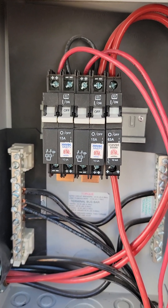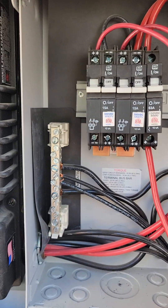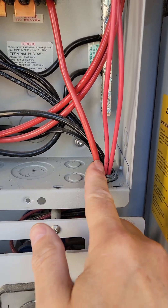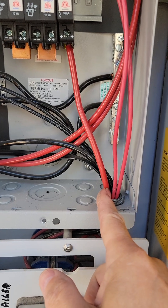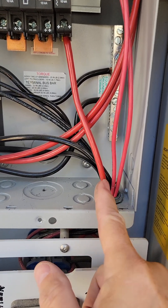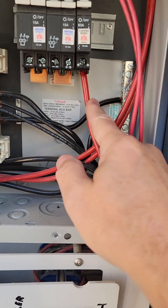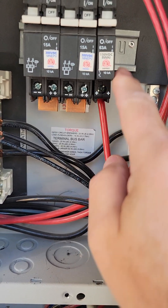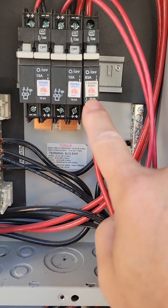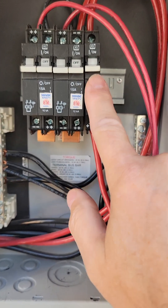It's not metal — you can literally break those things off really easily. This fat red wire that comes up from the bottom is coming from the battery terminal itself. Make sure that is also secured properly. Breaker number five is really the one that powers your midnight charge controller — if that's powered on, your midnight charge controller should turn on.